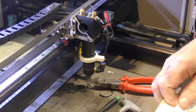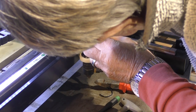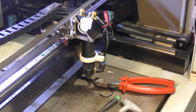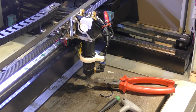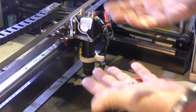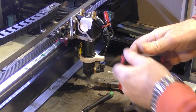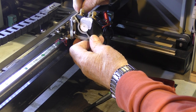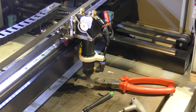We're just getting one of my little targets and we'll just stick that in that hole there, just to see roughly where we are. I'll turn my max power down to 15% and do a quick pulse. That's not too bad for the middle - it's pretty good that way. Just for the sheer hell of it, I will adjust it up because I've got to go up just a shade, to put that into the middle.